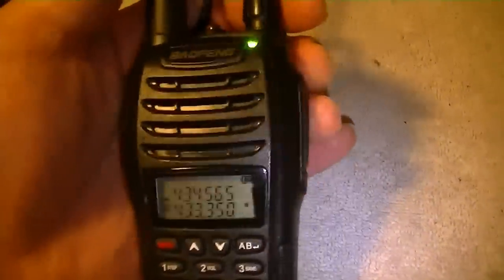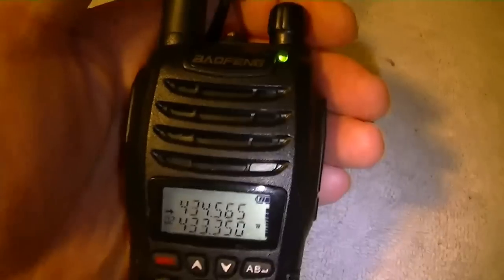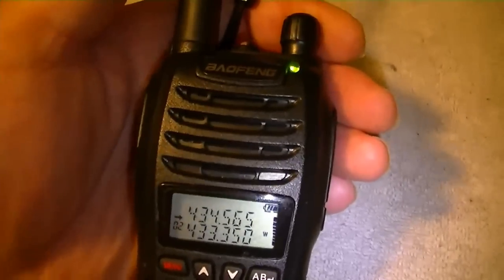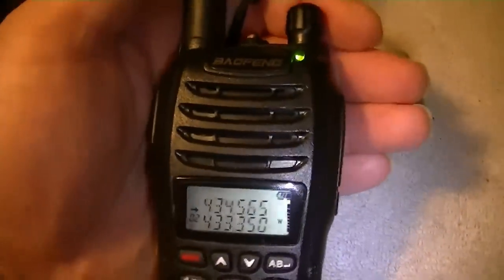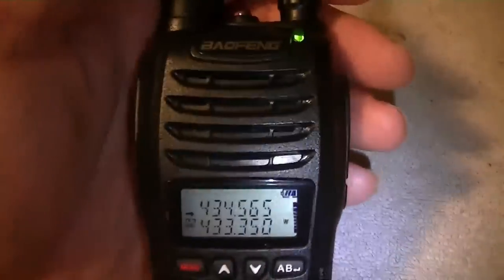I'm on the other side of the house now. Perfect, with the full signal. And the radio's on pretty low, so it picks up very low signals. It's the comedy music, because I haven't had a meeting to think about what to play. So now testing, I've had these transmitters go well over half a mile, for the size of them. The RF output's about 10 dBm, about 10 milliwatts. It's astonishing how far these can go.